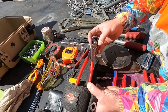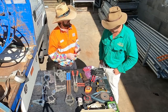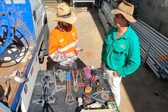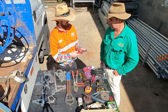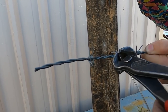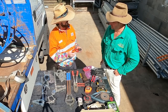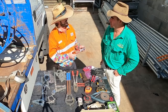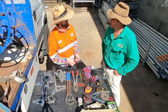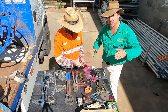A controversial piece of gear — end nippers. There are no crescent pliers anywhere in this toolkit. The only crescent pliers at Walters Fencing are the golden pliers Steve won in '99, and they're mounted on the wall. End nippers serve the purpose of twitching and cutting in the same motion. If you're twitching off tie wire, you loosely grab it, spin it, cut it, and you're done — extremely efficient. You can get into tight places, open a coil of wire, cut off clips, and trim rabbit netting. Once you get the hang of it, you wouldn't ever go back to a normal pair of fencing pliers.